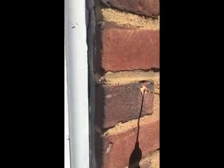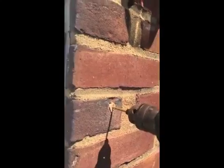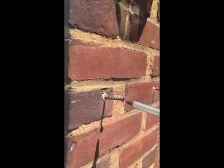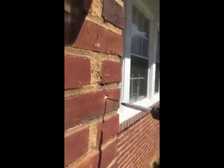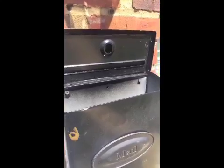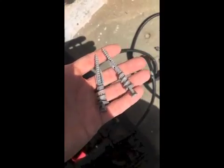Pilot holes for the screws, just match the shank of the screw or approximate it. Now drive your screws in, leave them about 3/4 inch still out to hang the mailbox. Snug up your screws a bit, and there you go. Who said you needed concrete anchors anyway?